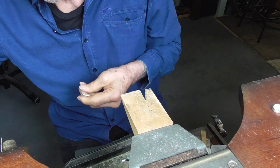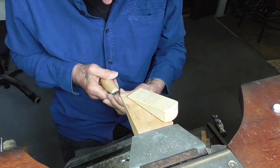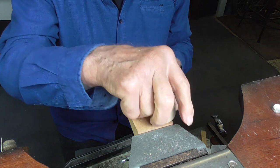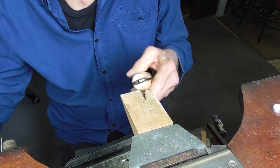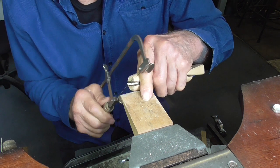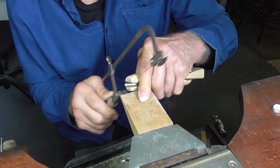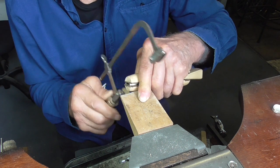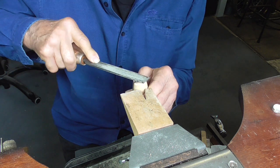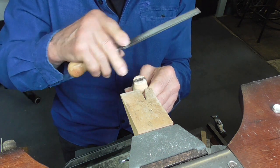And then what I do is I put it in an old style ring clamp. And that way I can saw and file right on the clamp. So cut just slightly proud of the clamp, and then you can use your Swiss number 2 cut, flat hand file, and you'll get both of these flat at the same time.